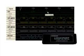A logic analyzer will make your life so much easier. It'll be able to synchronize all these different signals at the same time. You want to establish some kind of relationship — like, this goes up, the chip enable goes up, then you get data coming out. You have to establish these kinds of relationships to properly debug and reverse engineer.